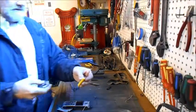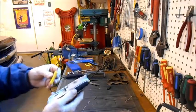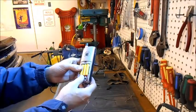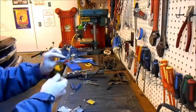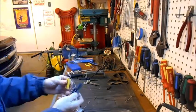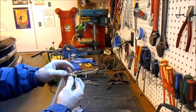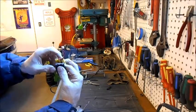We're back on the rechargeable telephone battery. This battery came out of this telephone, and it is now only holding a charge for about 5 minutes. So, as you saw in the earlier video, I have now soldered the ends of this battery to be very, very similar to this battery, and all I have to do is get this connector moved from here to here and we're away. The white will be the positive, whereas the old one was red positive, and that's about it.